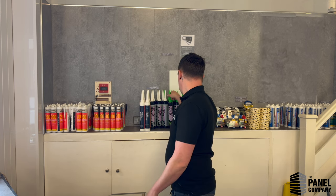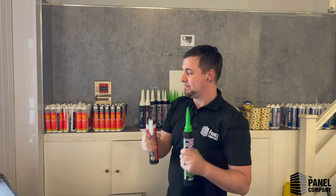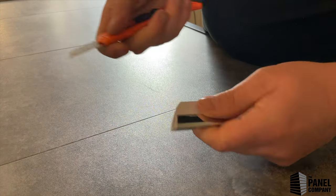So that's our trim demo done. You can stick any of those trims to our PVC cladding with either solvent-free paint grip or, if you're in a hurry and don't want your trims to move, maximum torque. Trims can be cut fairly easily with a Stanley knife, shaped however you need — mitered, etc. Thanks for joining us. If you have any further questions about trims, cladding, flooring, or any of our products, leave your questions and comments, get in touch, and we'll answer them either in a video like this or send you back an email with more information. Like and subscribe.